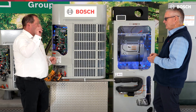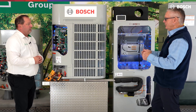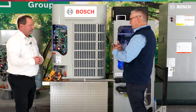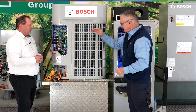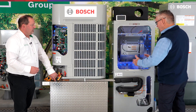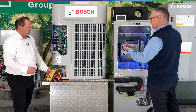It's going to take a little while to reach steady state, or to match our target coil temperatures that we talked about earlier. Literally what we're doing as a heat pump — we're taking the air that's coming through here and doing the refrigeration effect on it: taking the BTUs that we can extract from the air, putting them into the refrigerant, bringing it into the air handler, taking it through the coil, running air across it, and releasing those BTUs.